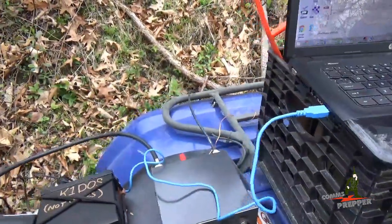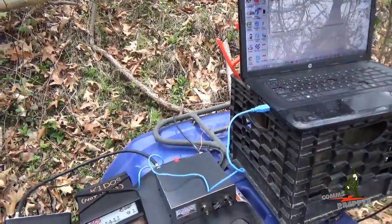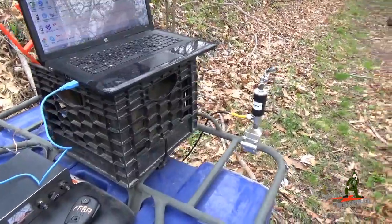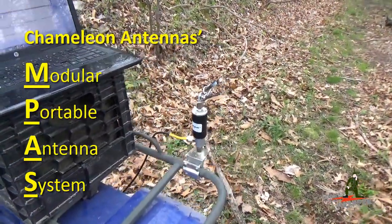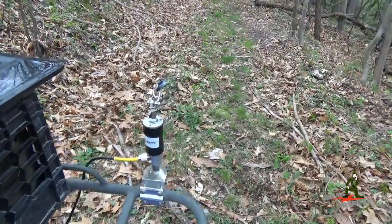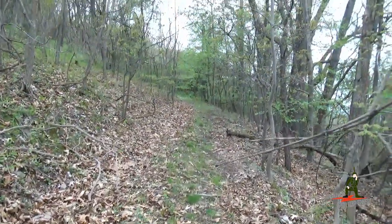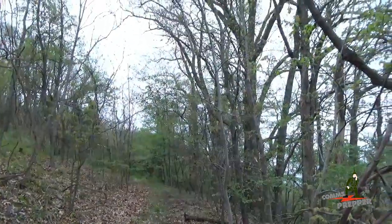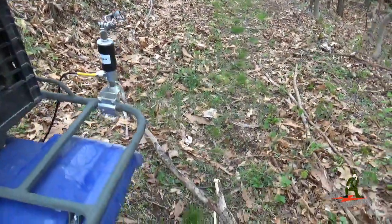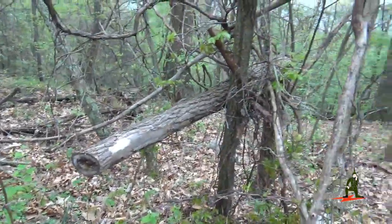The antenna - well, we improvised, as I said in the beginning of the video. I did my best to sabotage this weekend's video by leaving the radio and components of Chameleon Antennas modular portable antenna system back at the house. Here we have the hybrid micro base, and I'm using the counterpoise wire that comes with that kit as the long wire antenna. It runs out to a tree out there and then drops down. And I also have some stranded copper wire, running out down the hill here to act as the counterpoise.